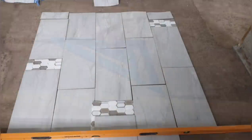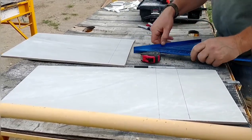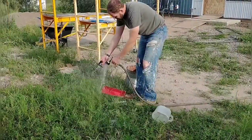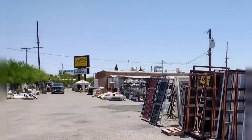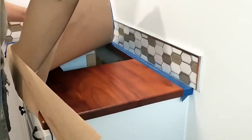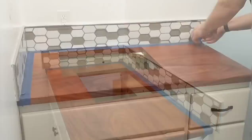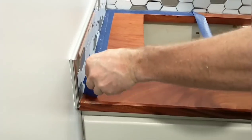I'm making a little drawing of how I want the tile to be, then laying it out on the floor so I can get an idea of what it will look like on the wall. It also helps me avoid mistakes as I start to mark and cut. We picked up these tiles during a trip to Tucson when we stopped at a used and liquidated building materials store - they were less than a dollar a foot. Good long hard-wearing porcelain tiles - but that's also why I needed to use the metal trim, since you can no longer get edge pieces for this type of tile.